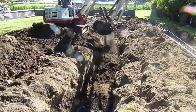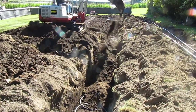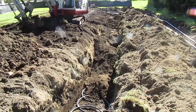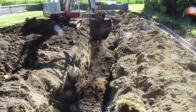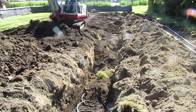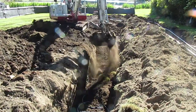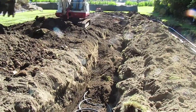Today is August 17th. This is the second trench. After we raked the bottom of the trench clear of any suspicious rocks that we thought were going to hurt this route, the backhoe operator is dumping the dirt over the loop while we're monitoring it to make sure there are no suspicious rocks going back close to the pipe.